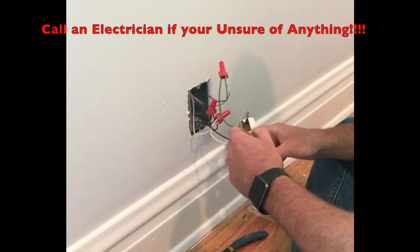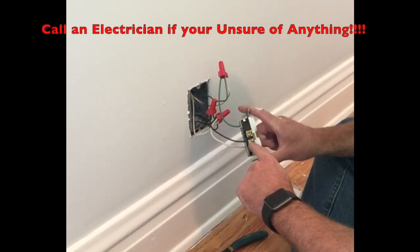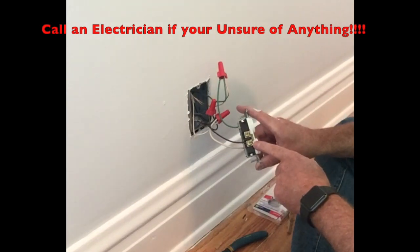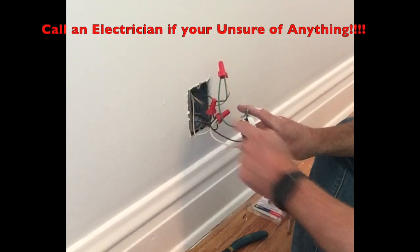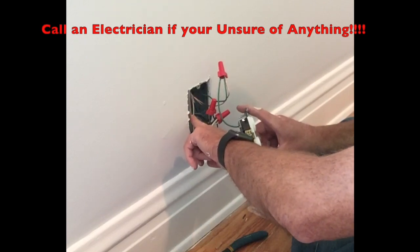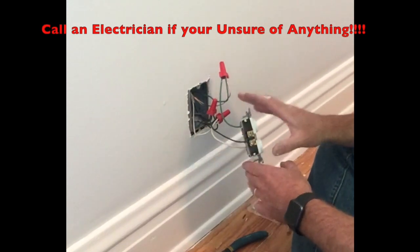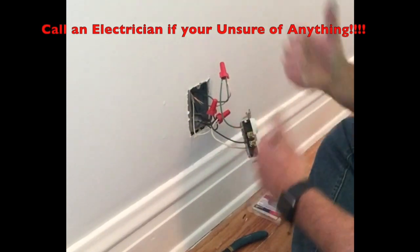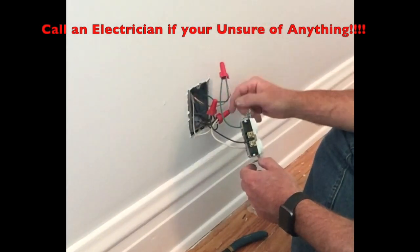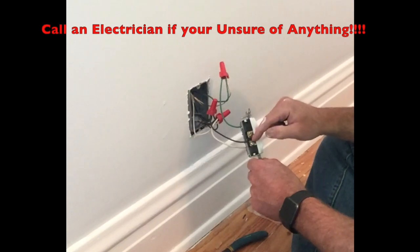It's not in the code saying you have to do this. Here are my personal thoughts on it. If you put tape on this, there's an advantage in the short term — if your hot wire touches the side of the box, it's not going to short out. There's a disadvantage somewhat long-term: if somebody ever comes to pull this out and work on it — which is always what you're thinking about, who's the next guy — the tape is going to be there and it's going to be a mess.